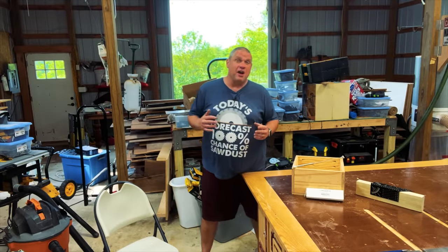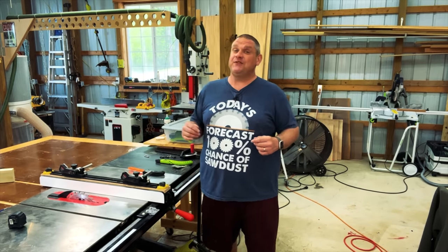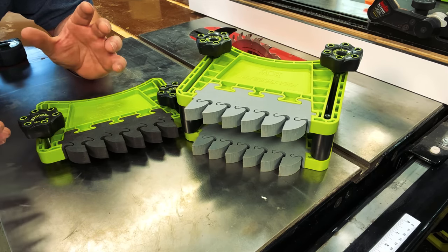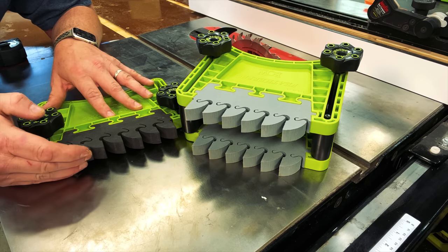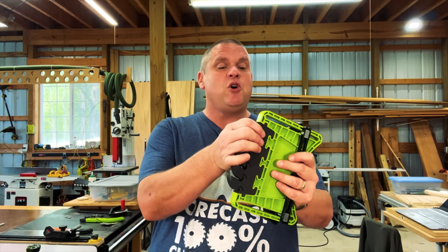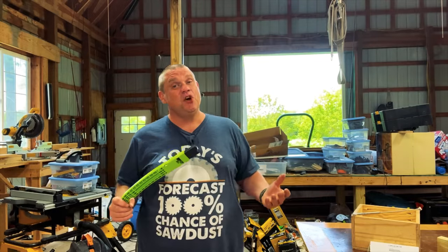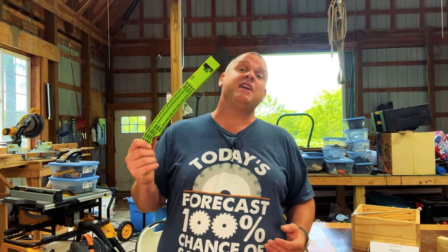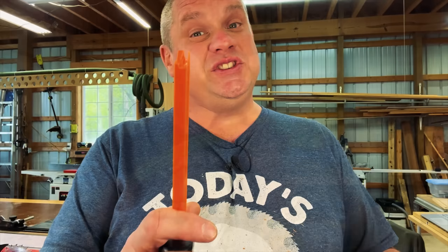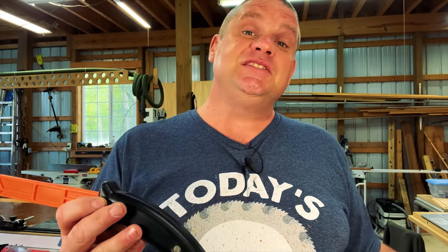Unless you've been living under a rock, you've probably seen a lot of YouTube channels featuring Bow feather boards — and there's a reason for that. Frankly, these feather boards are some of the best I've ever seen, and I even have a couple in my shop. They're popular because of the hard foam and the unique design of the feathers, which greatly reduces kickback. The foam is removable, so if you ever get a nick in it, you can simply replace it. They also make push sticks with that same hard foam — reversible and replaceable. Which is really nice because instead of throwing away the whole push stick, you just replace the tip.